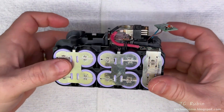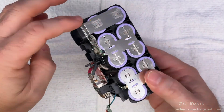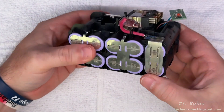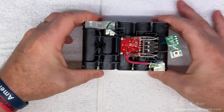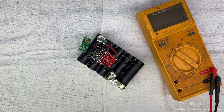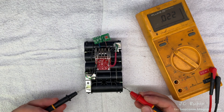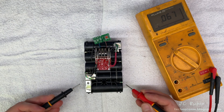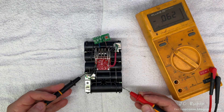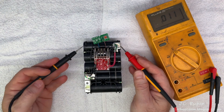Taking a look at the battery pack, we'll inspect for damage, smoke, or burning — I don't see any. What I do see is some robust pieces welded to connect the batteries together; very thick, actually half a millimeter. At this point I'll break out the multimeter set to DC volts, take a measurement across these two pads — and I got nothing, like zero. Check again, check others — still nothing, up here nothing. Things are not looking good.